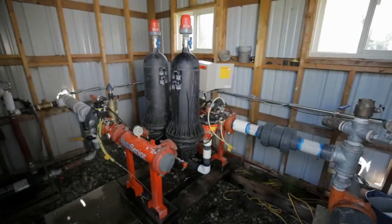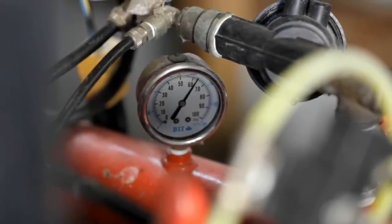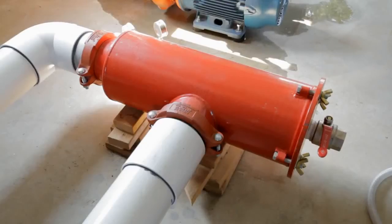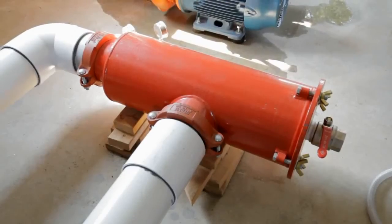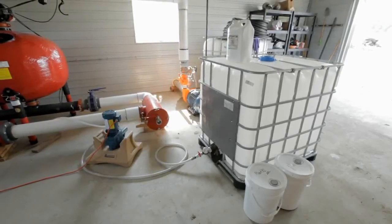Next, check that the filtration system is operating correctly, as this may be the reason for the reduced flow rate. If using a sand filter, consider adding a screen filter after to catch any sand escaping. Fertilizer and other chemicals should be injected upstream of filtration.